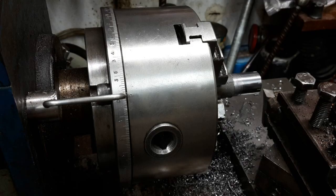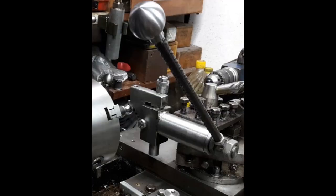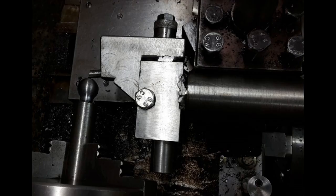The head of the cutter feed screw was inscribed with the graduations. The graduated chuck backing plate was used to index it. The cutter was ground on the surface grinder and held in the cutter head as shown in the sketch. I did not invest much effort as I was a bit unsure of how this ball turner would turn out. However, it worked better than expected and so every lever in my shop now has a ball at its end.